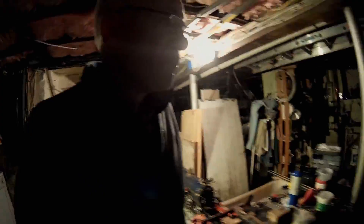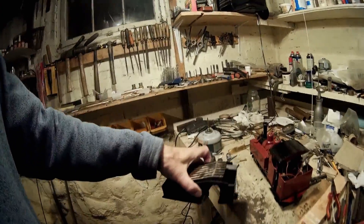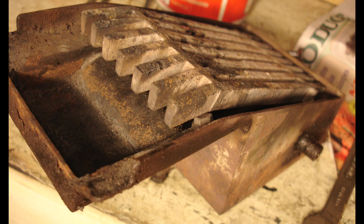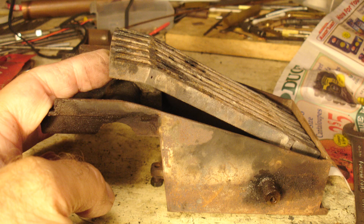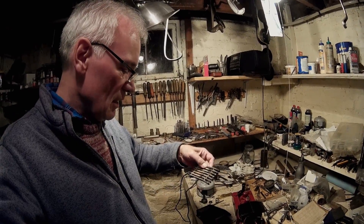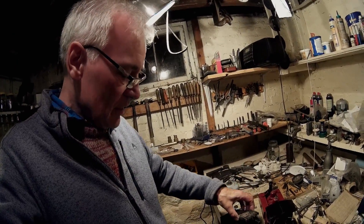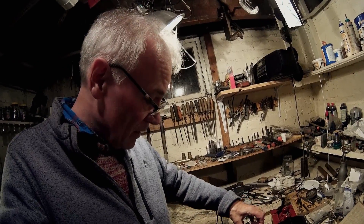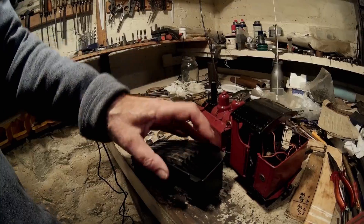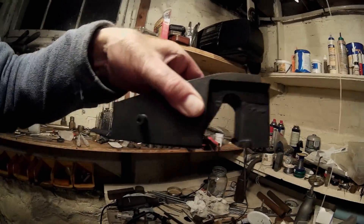Made the new ash pan — putting it up here on the bench. You can see the back end of the ash pan here. This is how the old ash pan looked — it's got no room for the ash to fall over the back end of that grate. So I modified the back end, made it much, much deeper, and gave it its own ash clearing door. Before that, the ash would build up and then burn through the cast iron grate. It's amazing how easily cast iron will burn once the coal is really alight and fiery and hot. You've got this space now so the ash will fall down into the hopper at the back and the hopper at the front.